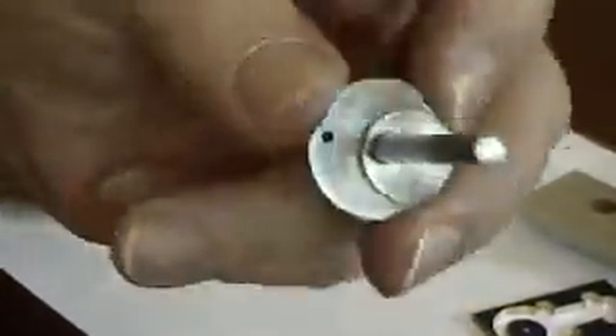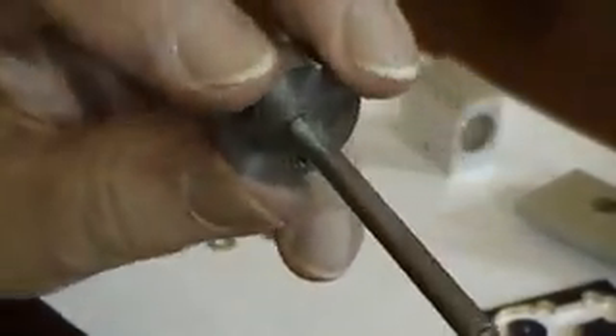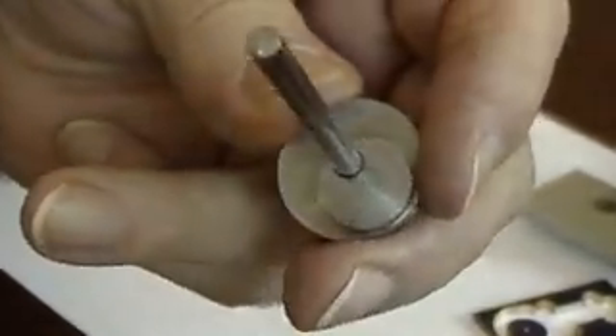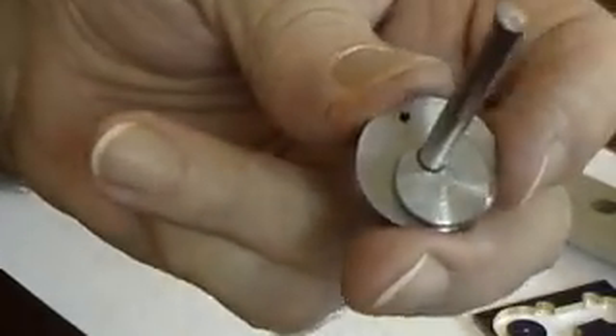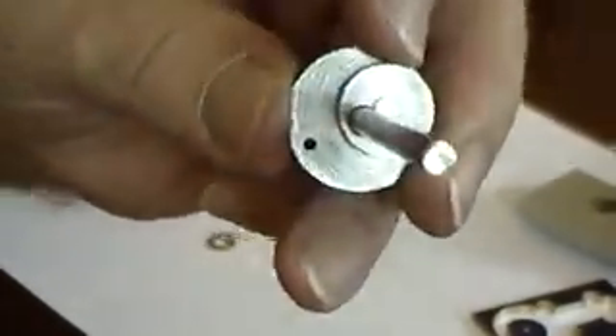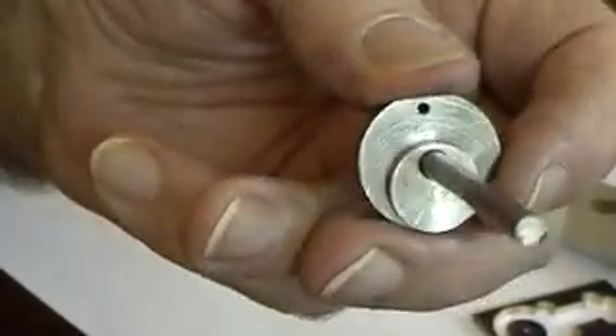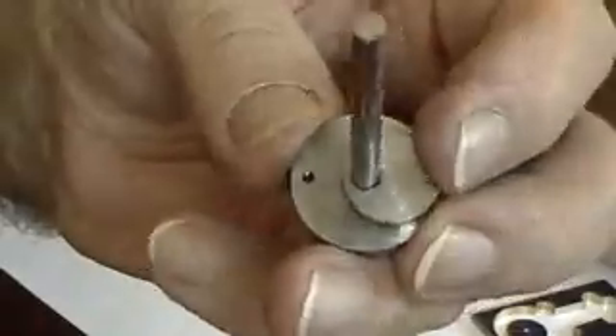The first difference is this is the crankshaft and the crank disc. Originally this was supposed to be machined out of one solid billet — the disc and the shaft — and the eccentric, which you can see here, was a separate piece. Since that had to be carefully aligned, I thought if I machine it all together with the crank disc it can't go out of adjustment at all. And it gives me a little bit of extra thickness so that I can press in the shaft, which is just ordinary drill rod, but that's a good steel. That's how it worked out — I made the crank disc and the eccentric all in one piece and pressed in the drill rod shaft.